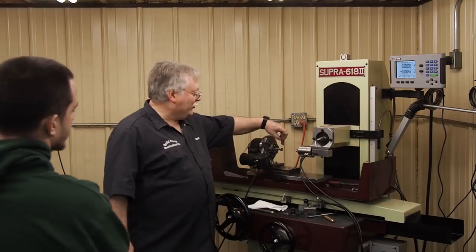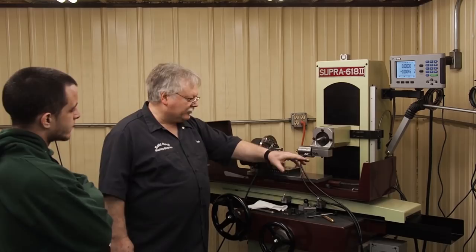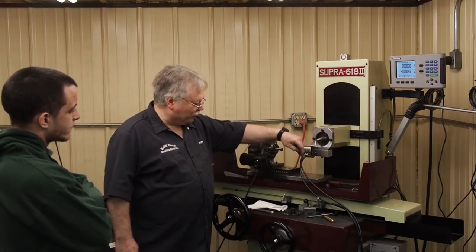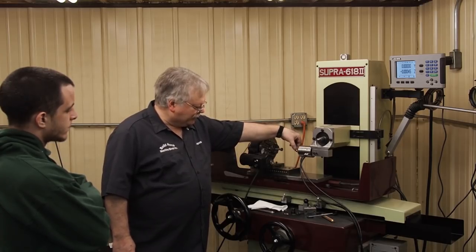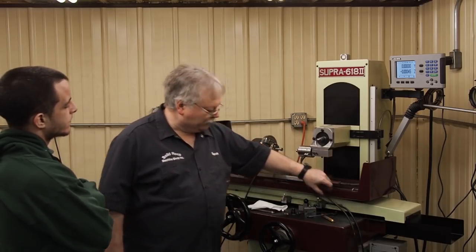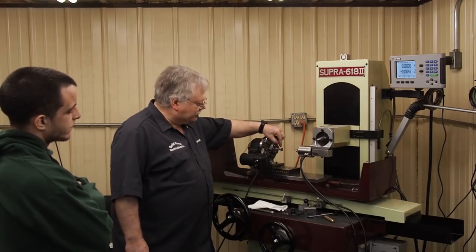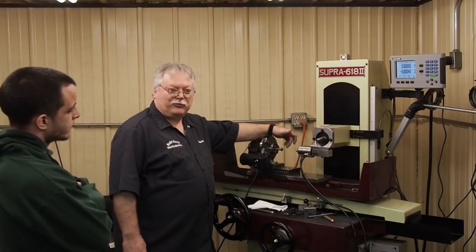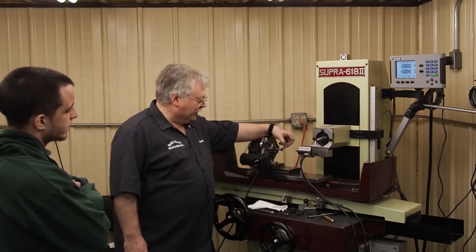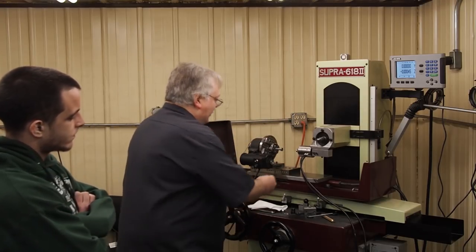Mike was just asking if we're putting oil on there. What's happening is there's an oiler in this unit, a metered system, that puts a certain amount of oil that comes with the air. And what's nice about this Planetary 500 is it kicks out a lot of the air here, and then you got this muffler system where a lot of the air goes and keeps it quieter. But you can see there's oil film coming over here, and I kind of like that because it works nice when you're dry grinding. You got some lubricant there, as well as the air coming out front that keeps everything from heating up. So it's a nice setup.